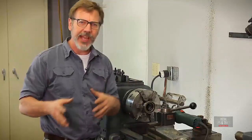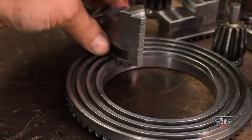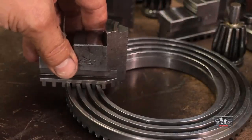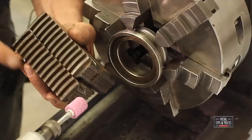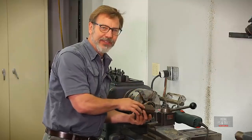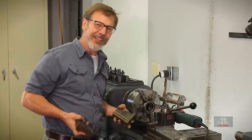You need to realize that chucks have a lot of — what I want to say — air in them. There's a lot of slop in the scroll and the way the jaw is attached to it. They have to, because the scroll that allows these jaws to move in and out changes radius on each thread. The engineering behind setting these up is really pretty complicated, so there's never really good pressure on any one of these teeth. They have to put slop in there so they will actually work together.